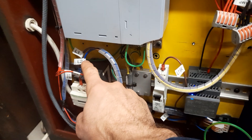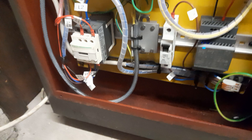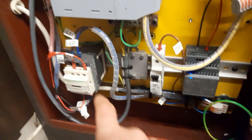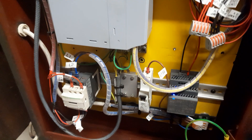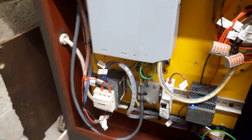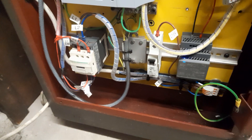I've only got live and neutral, which I've labeled as L1 and L2, and then down at the bottom there's T1 and T2, which go around to the top of the VFD. It goes without saying that the contactor doesn't interrupt the protective earth — the protective earth is wired in directly.